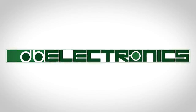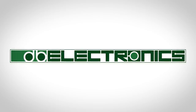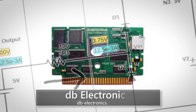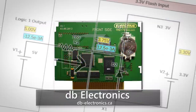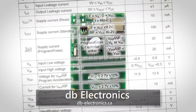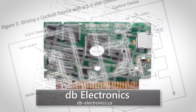Before we dive in, we should very briefly touch on flash memory voltage and how it applies to EverDrives. Back in July of 2017, there was a bit of a tizzy around a blog post by DB Electronics, who took a closer look at the memory voltage of certain flash and reproduction cards. He determined that a number of these operate at a lower voltage that is out of specification levels for the original consoles. The extra voltage is dissipated as heat on the cartridge side, which could cause a bit of additional wear and tear to the hardware, and some EverDrive models fell into this category.